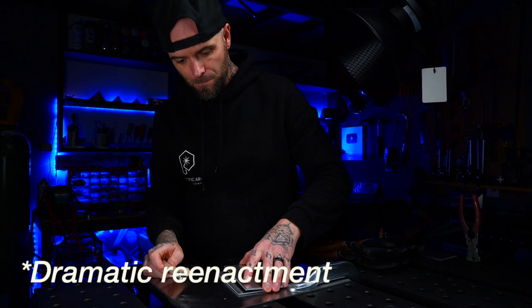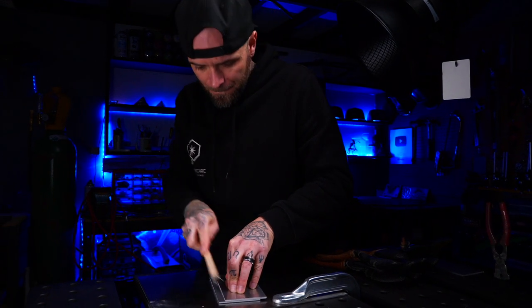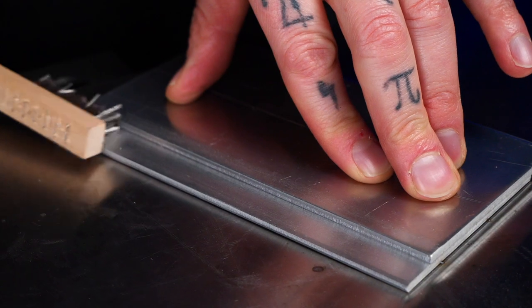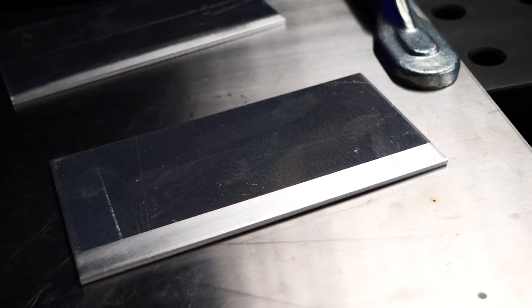Take a look at what I was doing in the video. I was setting up to weld some outside corner joints for a demonstration for a few students. You see how I have another piece of plate positioned lengthwise — I'm essentially using it as a ruler. Anytime I have an outside corner joint to weld, if I can set things up like this, I always take the time to do so. In production TIG welding, which I did for about 20 years, I would use this top plate as a ruler to brush a clean and straight strip parallel to my welding path, holding it at an angle to brush the edge of the plate as well as the surface beneath it — essentially wire brushing two plates all at once. Then I remove the top plate and look at how straight the brushed surface is. It's perfect.